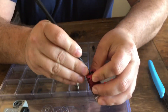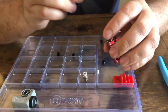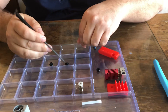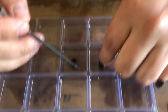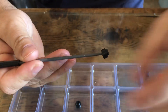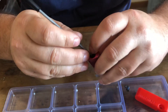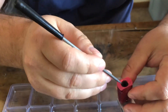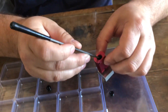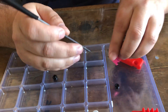So what I wanted to try — I came up with a couple ideas and here are some versions. What I wanted to do was make a washer that fit tighter in here, that didn't have the slop so that it stayed in the center, and then I wanted a spot where the taper was bigger so the PTFE tubing would fit inside of that.